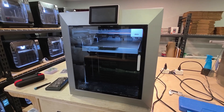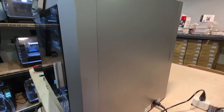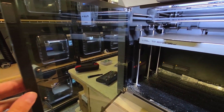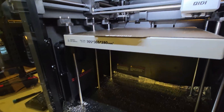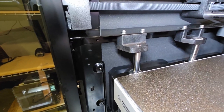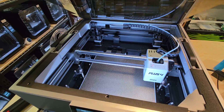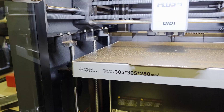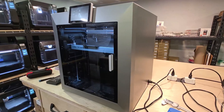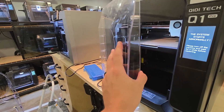As for the build quality, I think the printer looks excellent — very modern and futuristic. There are some panel gaps, which honestly don't bother me and don't affect the performance. I do like the premium glass doors — it's definitely a nice touch over the Q1. The printer is a lot heavier, and taking measurements, the Q1 Pro has a 1.25mm sheet metal frame while the Plus 4 has 1.5mm, making it slightly thicker and more rigid. It also has 10mm linear rods and lead screws compared to 8mm on the Q1. Overall, the Plus 4 is pretty stout — nothing on this printer feels flimsy, which can't really be said about the Q1. But at the end of the day, they both put out great quality prints, and ultimately that's what's most important to me.